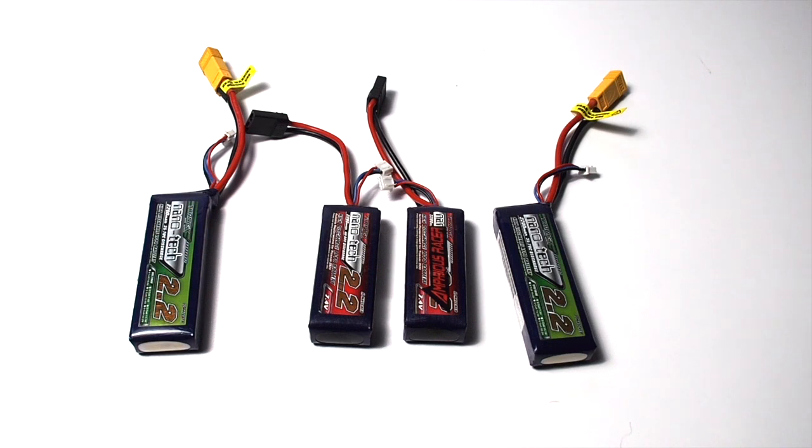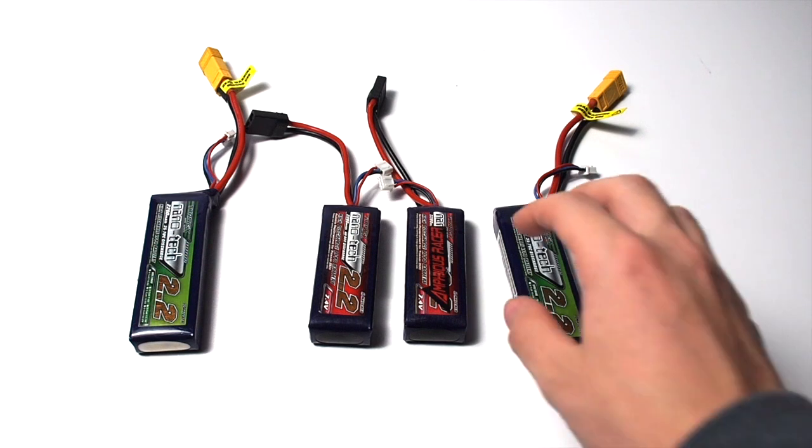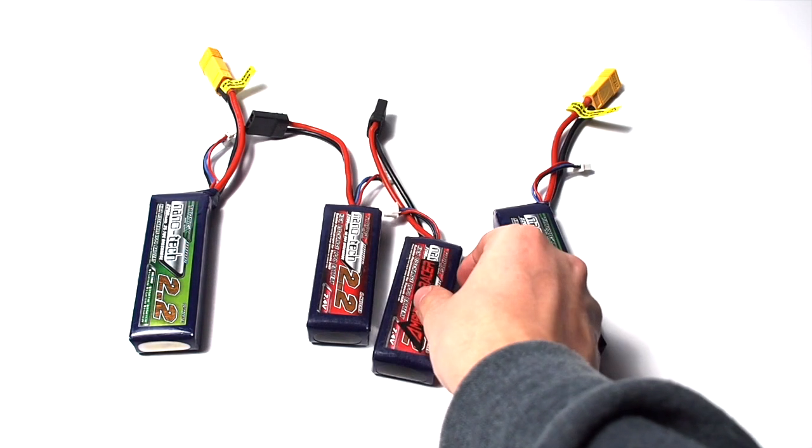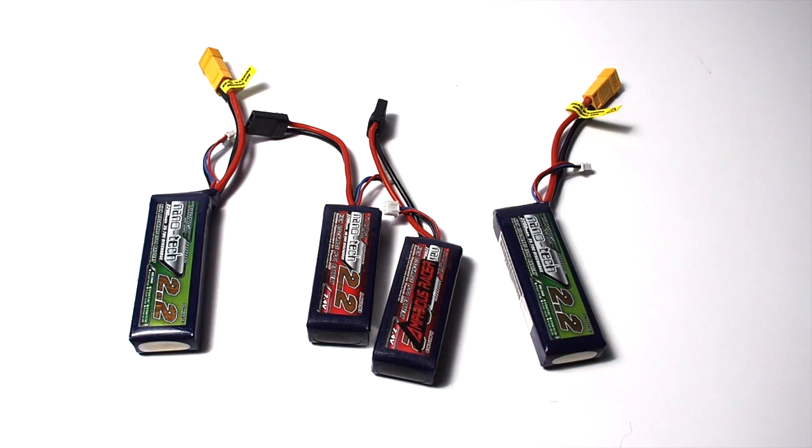So if you're in that boat, be a little more careful. Always supervise your batteries as you charge them, but in particular if you think you have slightly puffed batteries, start by charging them at a very slow rate — a full charge at a very slow rate under supervision. If something seems like it's going wrong while charging, stop and dispose of the batteries properly.